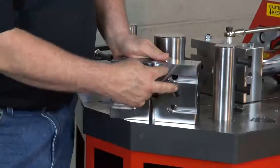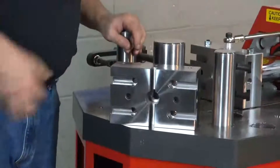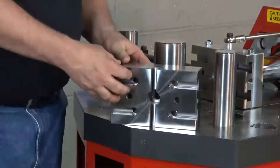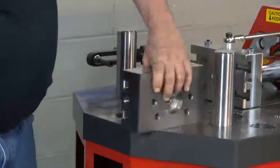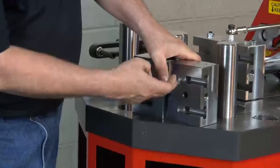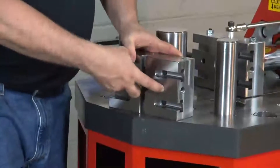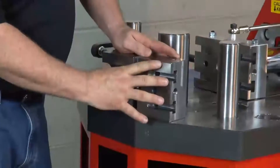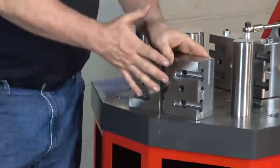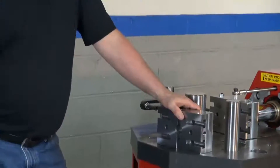Other features: on a lot of machines you can bolt stuff onto the face of it but you can't bolt anything through it. Supposing you wanted very small tooling and you were going to bolt a plate on it but didn't want bulky bolts or nuts up front. What we've done on this block is there are six 14mm holes running through it. They're reamed precision holes. You can bolt tooling on here and use either the pilot hole or those through-holes to physically bolt it to the machine. That just tremendously simplified making tooling, which as a consequence drives the cost down.